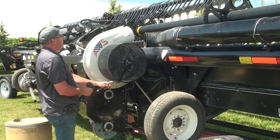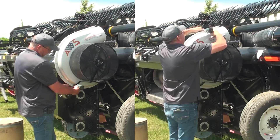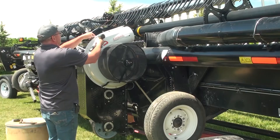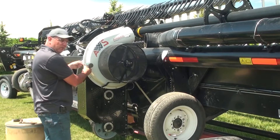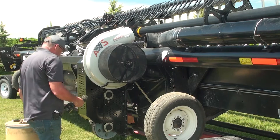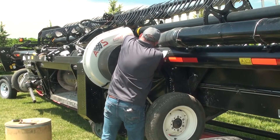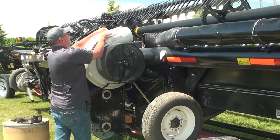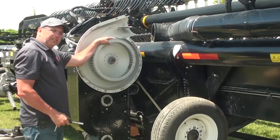There's one special bolt used on the rotary screen brush, and two slightly longer bolts used for the lift hook. I'm going to leave one bolt in here just for good measure while I remove the rest of them. With all the bolts removed, I'm going to slide this housing off and set it aside. This exposes our impeller.